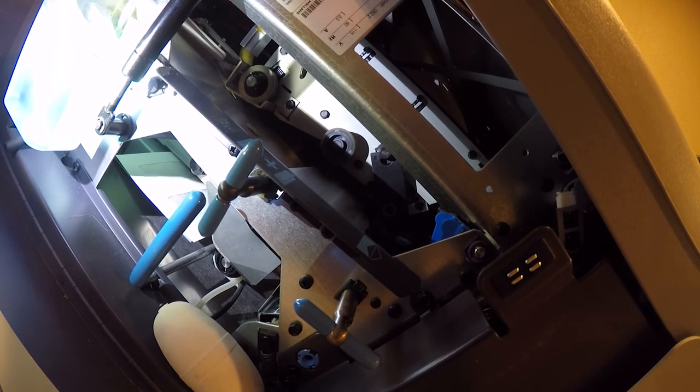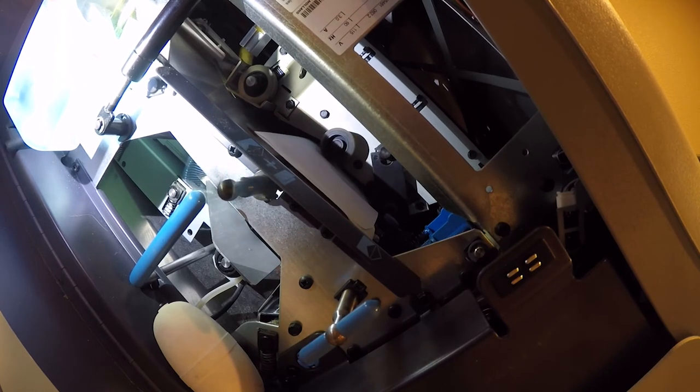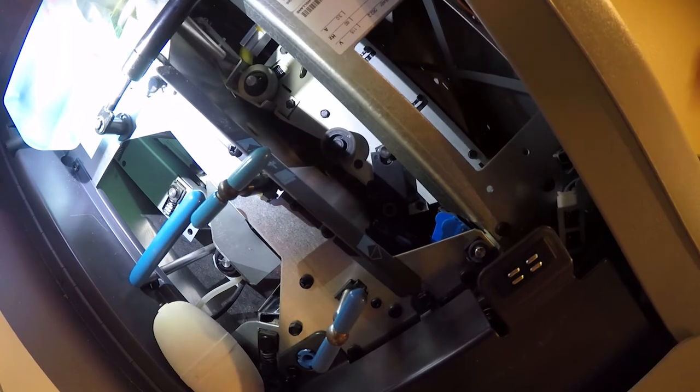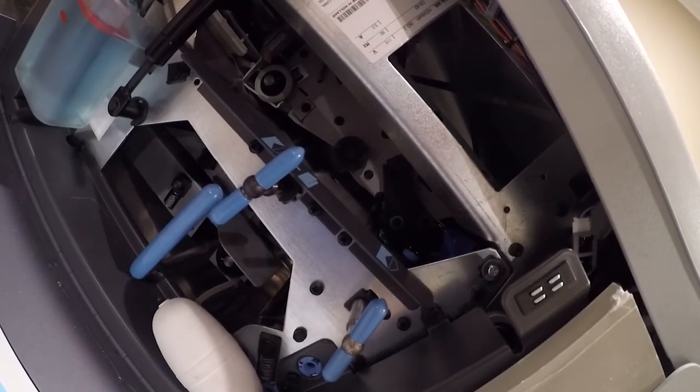Touchy. A misfeed. It took all of the paper again. I don't know why it's doing that. That's new. All right, so I got some other issues too. I got to print some more copies to run in here. All right. I think I got it fixed. I adjusted the tension back like I found it on that second feeder because that's where the problem's coming from.